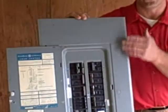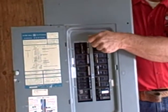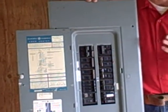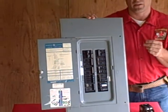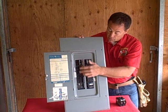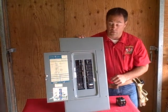What that means is there is no main breaker like what we'd have today to shut your whole house down. What the code has done is they've allowed us throughout the years to have six disconnects that will shut the whole house down. In this particular case it would be these breakers here that would control everything.